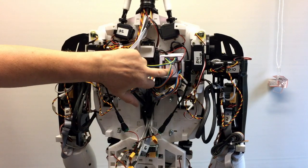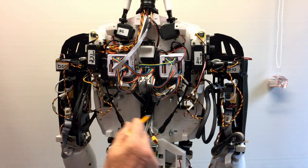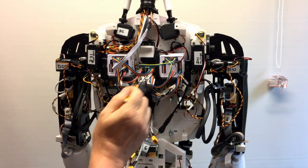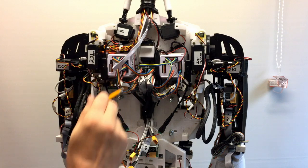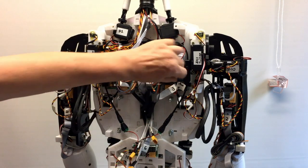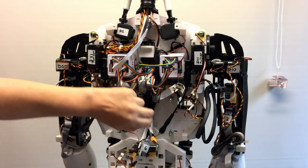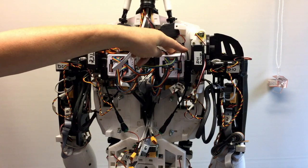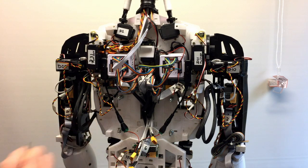power coming in. I'm running these at 12 volts straight off my mains power supply. So the mains comes into the distribution board. 12 volts is going straight through to those, and then I'm dropping down through the BECs to the other units on the switches. So everything else is running at 5 and 6 volts, but running at 12 volts. Just here I've got a power supply for the NeoPixel, which is sitting inside for the front. I've also got a power lead going off here, that's running at 12 volts up into the head, and that's going to be supplying, via another voltage reducer, the power amplifier for the audio, and also the little LED in the eye. The LED's got a built-in resistor, so I don't have to bother about running in resistors.